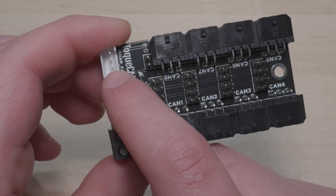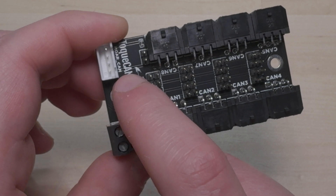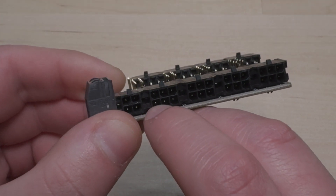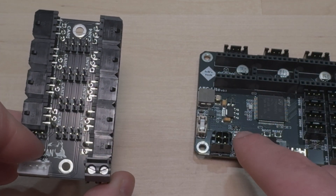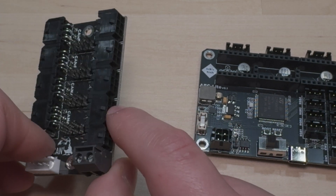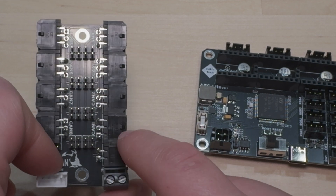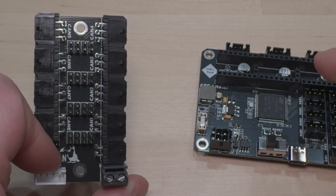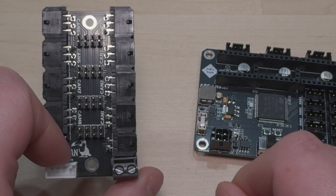That's why this CAN hub follows proper CAN topology. You have your CAN line connected here — depending on which pair of pins you use, it goes to this connector. You run CAN to your tool head, join it with the other pair, and it comes back from your tool head. The middle pins are for power — 24 volts or whatever voltage — and ground. So CAN runs to your tool head and back, then to the next tool head and back, and so on, meaning your CAN setup follows proper linear topology.